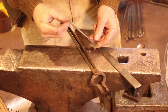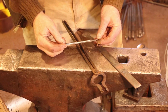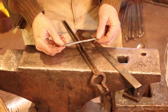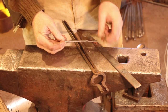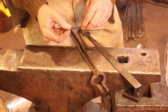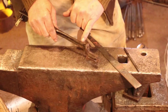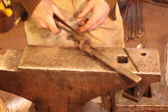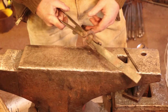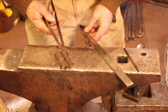For this part of the process, you're going to need a drift pin the size you want the inside of your eye — very slightly smaller so that you can drill it for a more accurate eye size. In this case it's quarter inch, or about six millimeters. This pair of offset tongs from Off Center Tool Works seems to work really well for holding the hinge mid-strap. I really like those for doing this, so those are the ones I'm going to use. But whatever tongs you have that work.